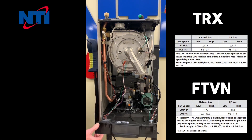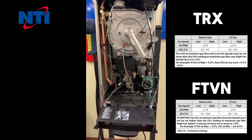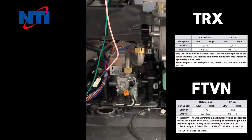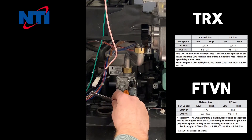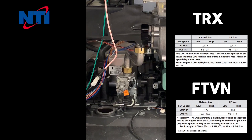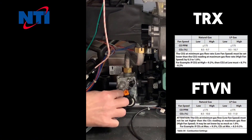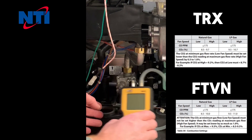To hook your manometer to the gas valve line pressure test port, lower the display. You will require a T15 TORX screwdriver. Loosen the gas valve line pressure test port — you do not need to fully remove this screw; it needs to be loosened several turns in order to take a reading. Place the tubing for your manometer over the test port, and at that point you can monitor your gas line pressure for the remainder of the test.